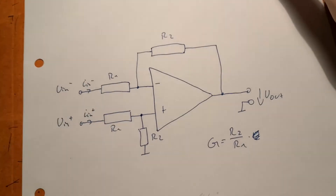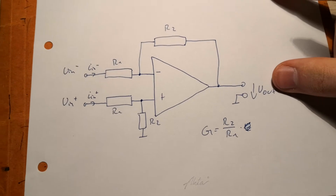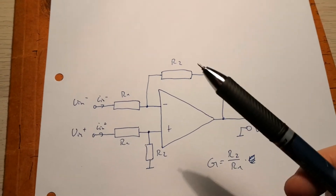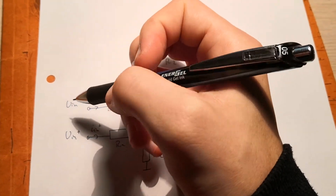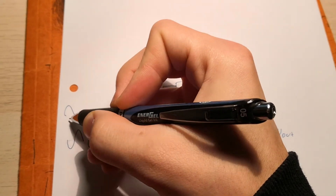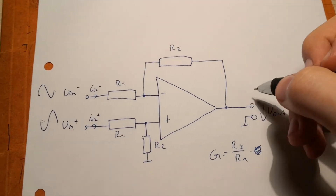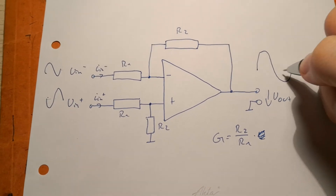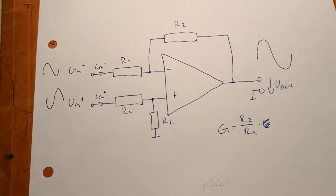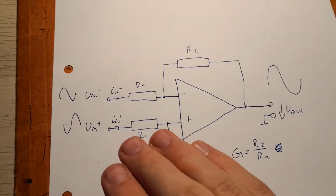The next circuit is the difference amplifier. The summing amplifier is a basic one you should already know, but this is a little different — it has two inputs, a negative and a positive, making it a differential amplifier. It takes a differential signal: one signal going like this, the other inverted 180 degrees out of phase. In the end — spoiler — it's going to produce one single-ended signal that's twice as big, referenced to ground, which we can send to our speaker or headphones.